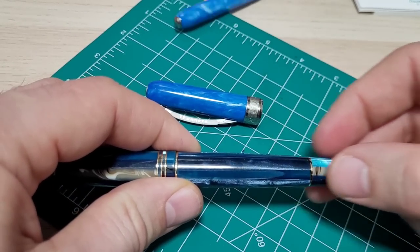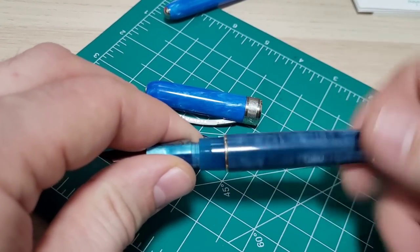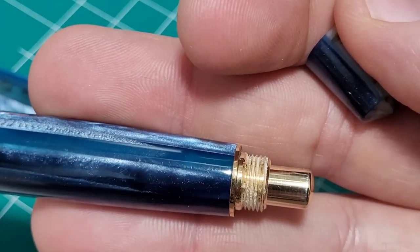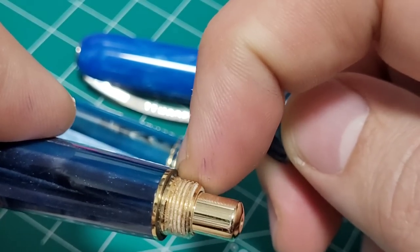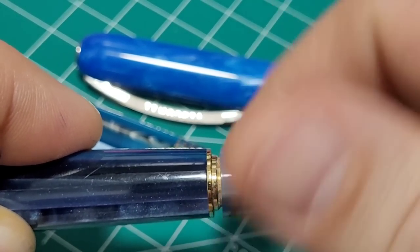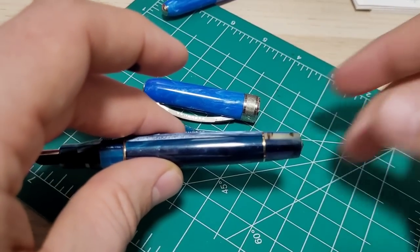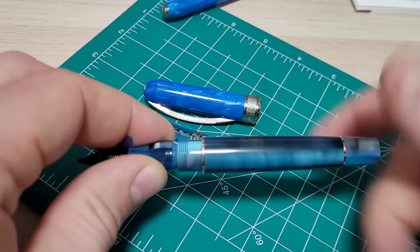I found a similar issue with the Leonardo Memento Zero — a beautiful, fairly well-constructed pen where everything goes together nicely. Until I came to the blind cap. Here we have metal and plastic, and if you zoom in you can see all this lovely dust — it's chewing up the plastic. The thread does stop so you can't over-torque it, which is good. But the thread profile and pitch just aren't appropriate for these mating surfaces. So for this pen, I don't use the blind cap at all. I just unscrew it like a regular pen, fill it that way, and away we go.